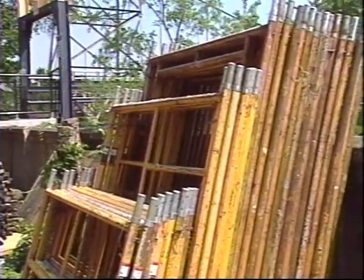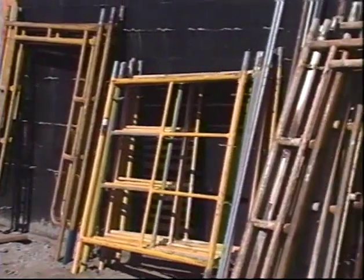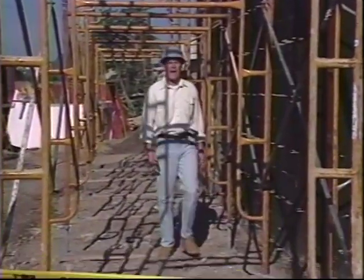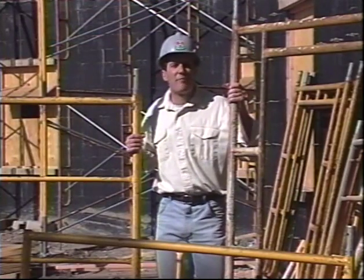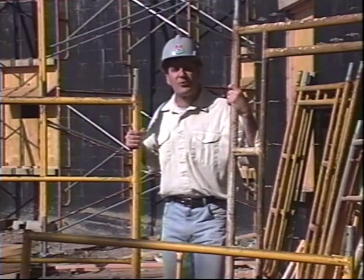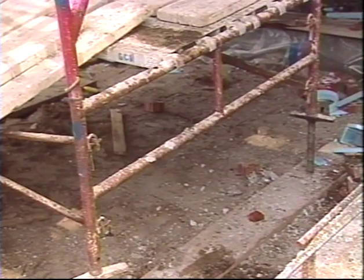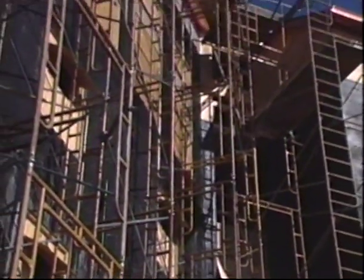If it's up to you to decide what scaffolding to put up, your first consideration is selecting the size and style of frames for your application. If you need access along a run of scaffolding, you would use these open-ended or walk-through frames. Tall units will get you up faster, and intermediate units give you options to adjust the height of your work platform. A little pre-planning and the right combination of frames will keep you from having to work in an awkward or dangerous position. Cross braces are designed for specific frame sizes. The correct cross bracing controls the length of the frames so that they'll stack uniformly and take standard lengths of planks.